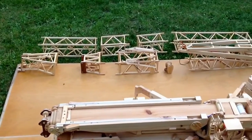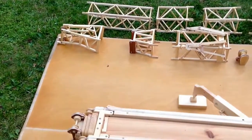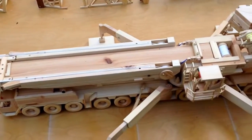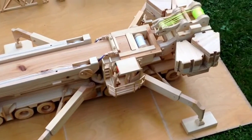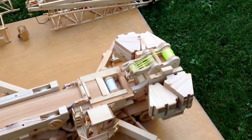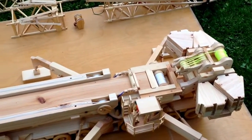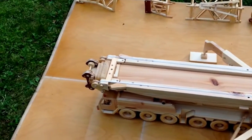All the rest of the parts have been delivered for the luffing jib. The crane has been set up, the cab has been swung into place, the base plate and all the ballast, luffing jib, and luffing winch are in place. So we'll start to set up the main boom extension and luffing jib now.